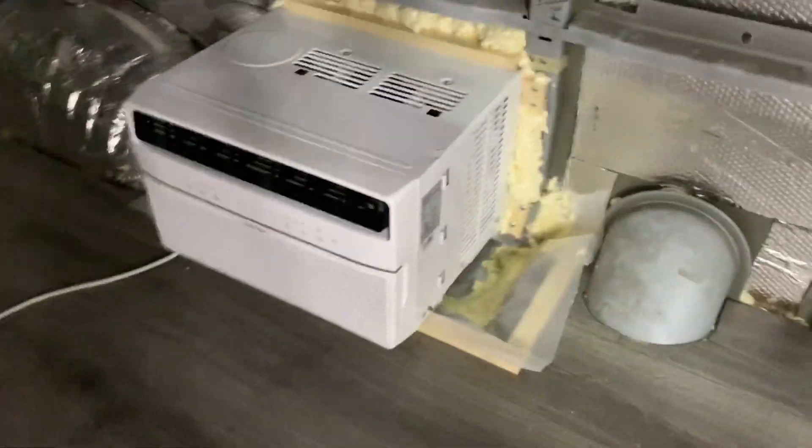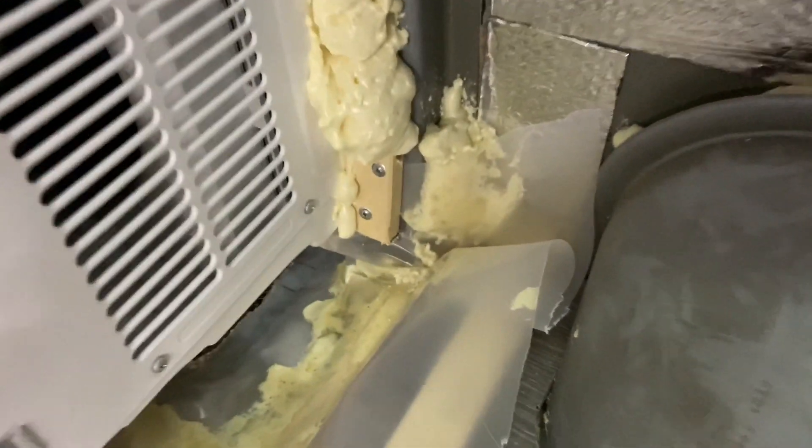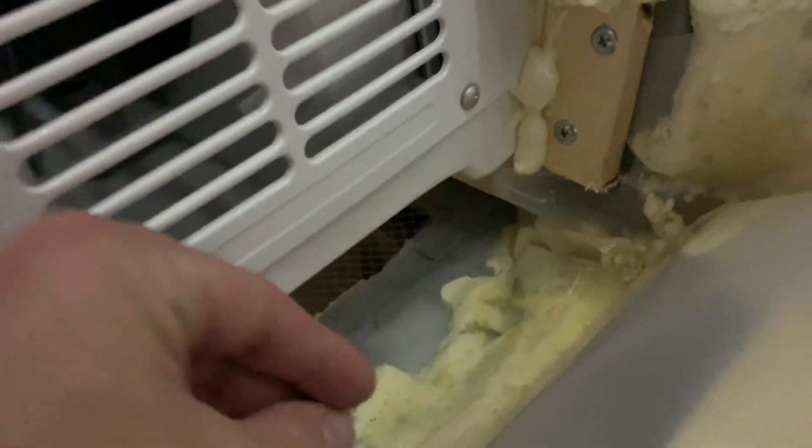I really want to make sure it's pretty tight so it doesn't get sucked up into the bottom of the air conditioner. The AC is installed — it's connected with eight screws total: two on both sides going into the one-by-two up top, and along the sides I chopped the one-by-two, used some sheet metal screws, and sunk a screw into the front metal pillar — same on the other side. I'm really happy with it, it's really solid. A little expanding foam on the bottom over the plastic sheeting to keep it sealed, and silicone all the way around the metal.